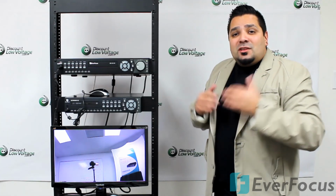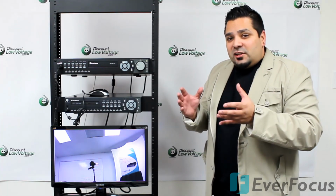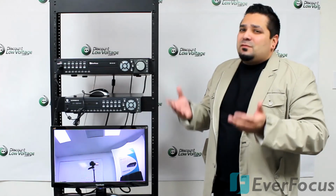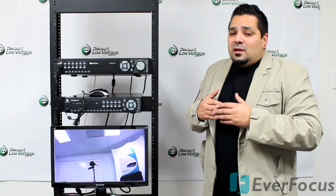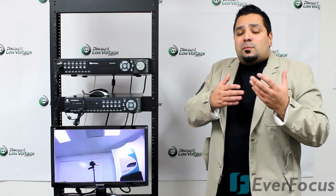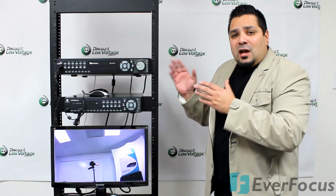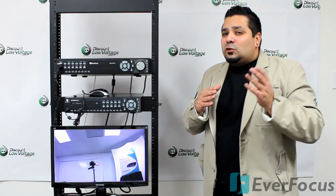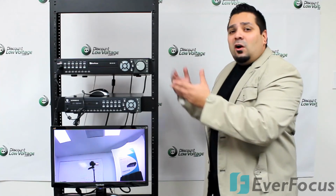Another thing I do want to mention, the footage and the feedback from the contractor customers has been really good after seeing the quality of the HD cameras. Of course, 1080p, 720. That's the only route they want to go. If you are a contractor who does this for a living, you might want to visit your previous sales of traditional analog systems and maybe offer this as an upgrade solution, because you don't have to upgrade their wiring. You can still use your old coax RG59 cabling, which is pretty cool. Just upgrade and update the system, DVR, and cameras.